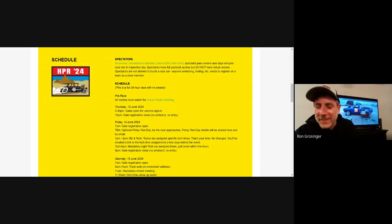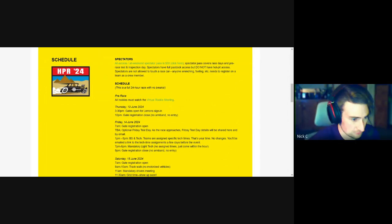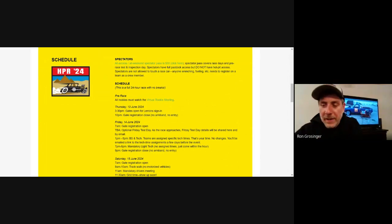So the amazing thing is that you're doing this. It's so cool. Oh, I have a very layman's question here. When you're driving that truck, you got the net gain motor hooked up to a transmission still, or are you going direct? What are you doing? It's direct. Really? Yep, to a Miata differential in the rear. Interesting. That saves us about 200 pounds, I think. So it's pretty gutless from a standstill, but when we're running 40 to 100 miles an hour, it doesn't mind. So where is the lag in the beginning, right? Yep. So what is it equivalent to, let's say fourth gear maybe, or fifth?